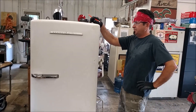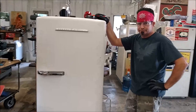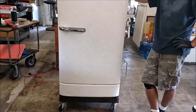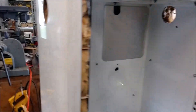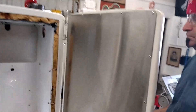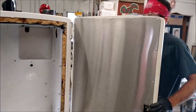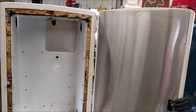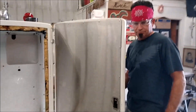We're going to do a little video on how we do our refrigerator smokers. This is Andy — he'll walk you through how he's building this one. First thing you've got to do is find yourself an old refrigerator. Something that's metal lined on the inside works well. This one has porcelain metal inside. We removed all the plastic that was on there — there was plastic on the door — and we put a sheet of stainless on here. You don't have to have stainless; a regular sheet of 13-gauge steel would work well.